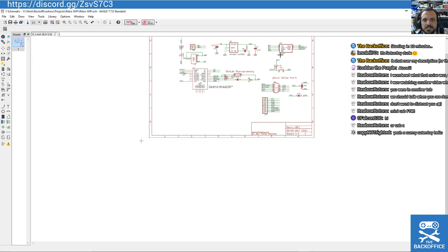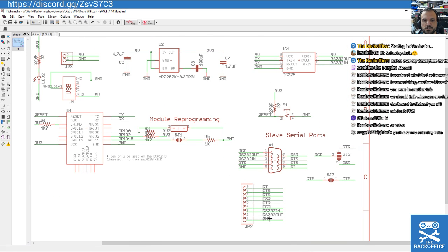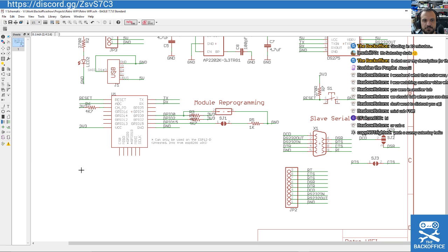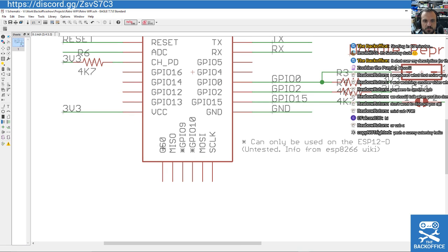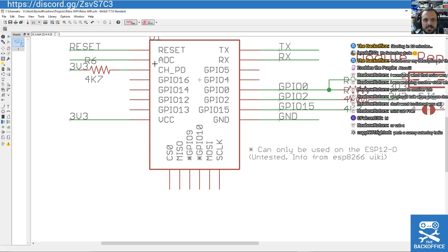I want to solder this internally anyway, so I'm going to just try to hook up these pins and the power lines internally to it. Now, something I've just deleted from here is a big connector, and it was a big connector hooking up all the spare GPIO, because you've got a spare SPI bus and you've got a spare analog to digital converter input here, and a whole mess of general purpose I/O lines that we can use.